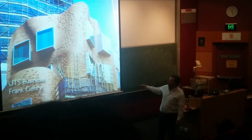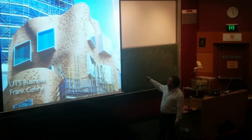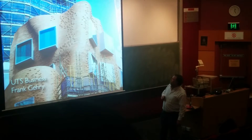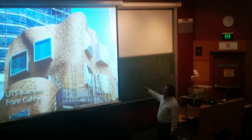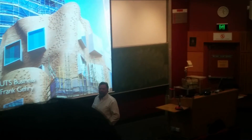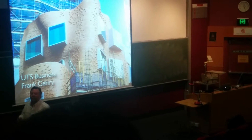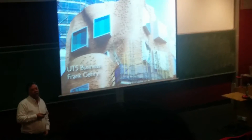And as you can see, these things go straight into the building — so look more carefully, more closely there. What happens at that junction? It's probably a lot of silicone involved in making that junction work. And of course, silicone is not likely to last forever. So what else do we expect to happen with this facade?